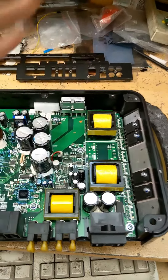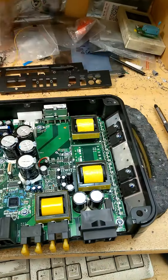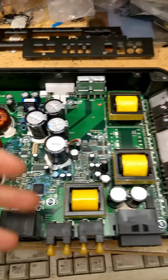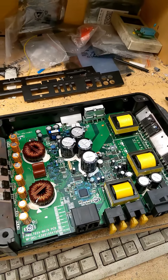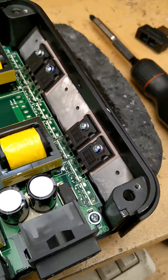Without changing these transformers, the rail voltage stays the same, which means it doesn't produce any more power at its nominal rated impedance. The only possible benefit from fitting more parts is you could wire the amplifier down lower - say 0.5 ohms - with more parallel components to handle that excessive current draw. However, the transformers are still a weak point and might saturate at a 0.5 ohm load.